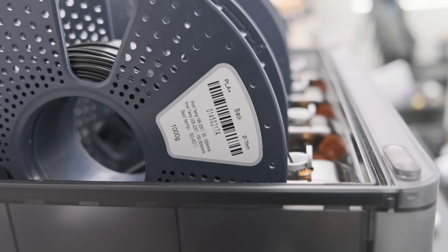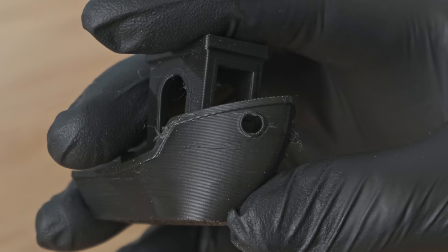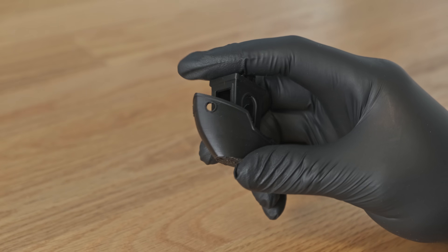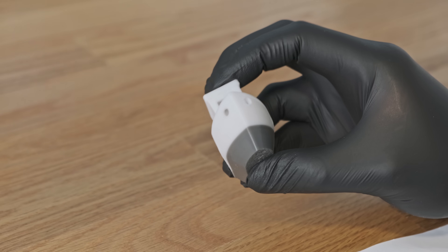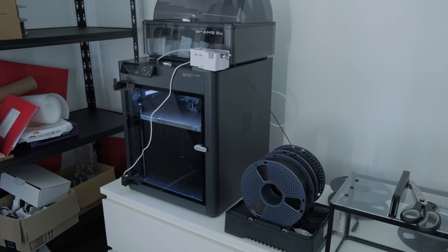I did a few comparison prints using the Bambu AMS2 Pro versus the Wyze Pro Filament Buffer. For the first test, I used two black spools that were exactly the same all the way down to the batch number to see if you could get a purely seamless transition. As expected, the AMS did the refill on an outside wall and left a lovely hole. But the print done with the Wyze Pro looked really, really good — it was perfectly seamless, not one blemish. Then I tried two different colors, and this time the AMS actually did the refill on the infill, so it came out looking nice too. But again, the Wyze Pro was flawless. At this point I was pretty excited — maybe this thing works. So I quickly whipped up a temporary mount in Blender, put it on top of my P1S, and used my filament dryer as the spool holder.